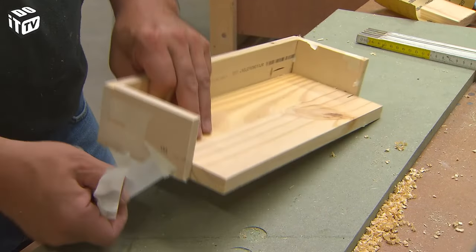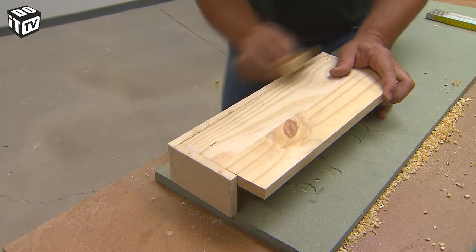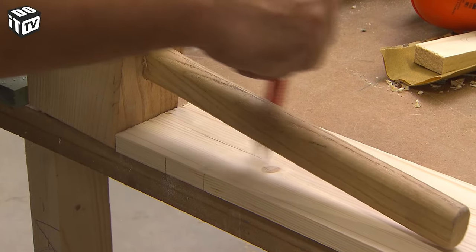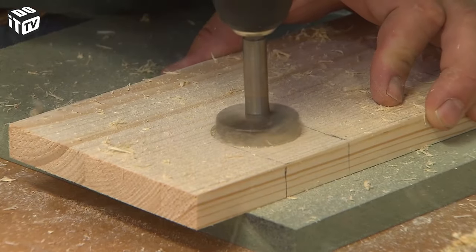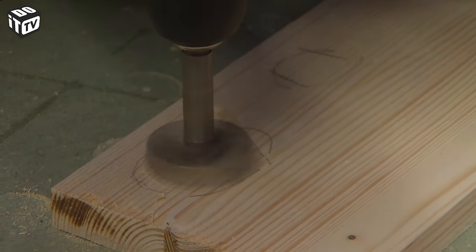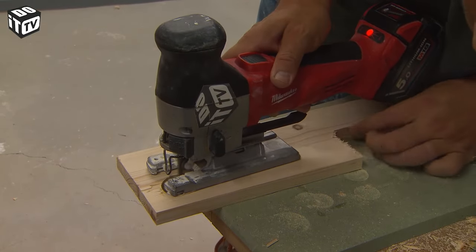In the meantime, our tray is dry and can be sanded. There you go, additionally prepared and ready for you to use. Now for the hammers. Create fresh drawings of your cut-outs — this varies per hammer. Create openings by drilling holes in order to properly position and insert the handle through them, ensuring a secure and functional attachment. Using the big hammer, we pull the recess through by using a jigsaw. With the claw hammer, our opening is simply not large enough, so the jigsaw will also be used to make that hole larger.